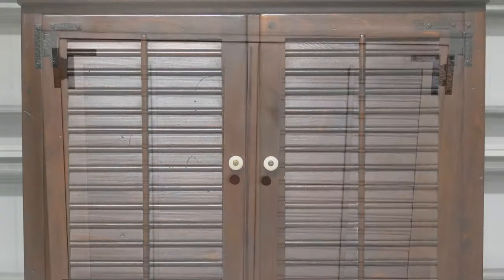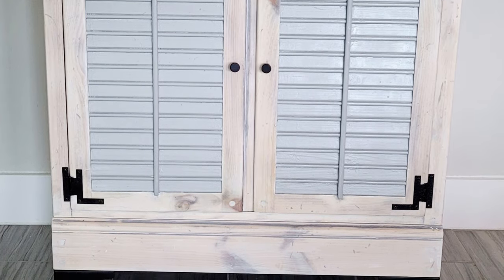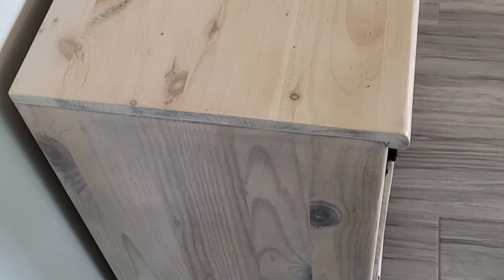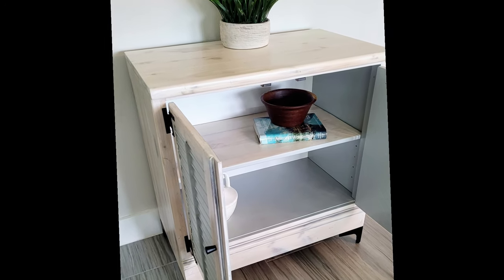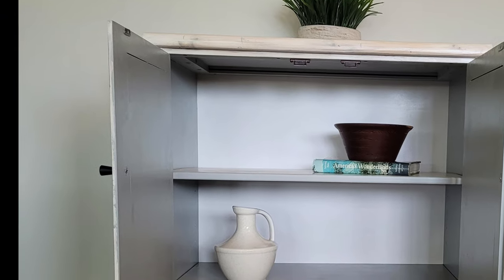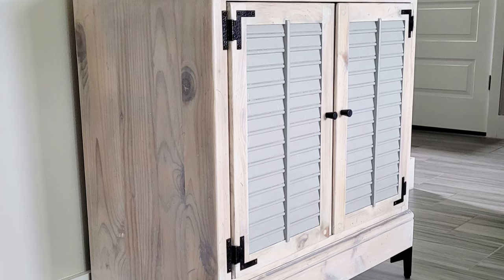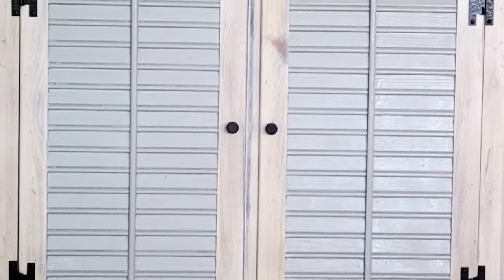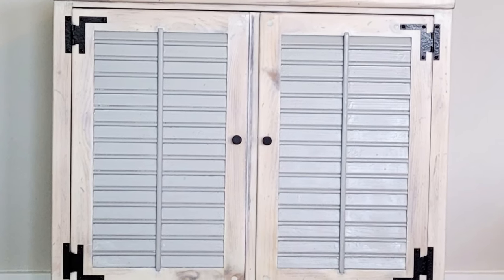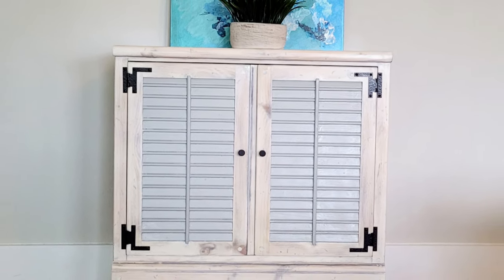Looks like it's finally time for the big reveal. While I did not initially want to paint the slats, if I could go back in time I would have applied paintable caulk in between each of the slats and gone directly to painting. Using stripper when I couldn't get to the back of the slats was not my brightest move, but hopefully you found it somewhat entertaining. If you could hit that like button, you'd be pretty awesome — and thanks for watching!